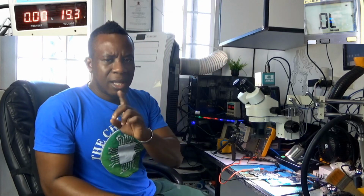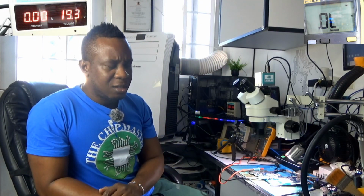Besides the AMD Kabini CPU, all AMD CPUs don't need 3.3 volts for the RTC section. It needs 1.5 volts. It's called VDDBT_RTC_G. The RTC VDDB G means the mechanical off, G state. G3 is the mechanical off